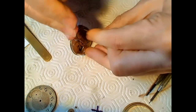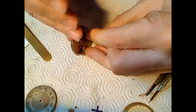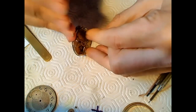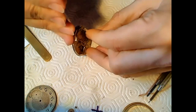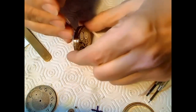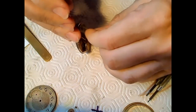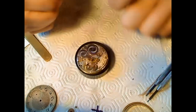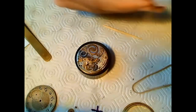A good cleaning will likely get this watch going again. I have to let the movement down again - I don't want to take this thing apart with pressure on the mainspring because that is not a very wise thing to do. So I'll just roll this down a bit. You don't want to let it go because that'll ruin things. That's pretty much it - no more pressure there.